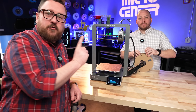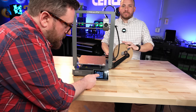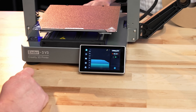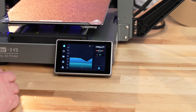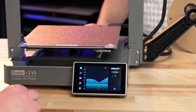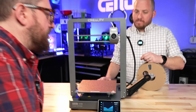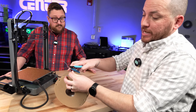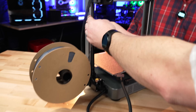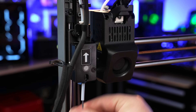We're going to go ahead and click OK, then figure out how to load the filament. I think we're going to select the hot end, take it up to 212 degrees Celsius and hit OK. We'll watch the graph as the hot end warms up. It's already at 136 and soaring upwards to 212 degrees Celsius where we will load our PLA Plus. Let's turn the printer around so you can see how we're going to load the filament. First we're going to take this and do a 45 degree angle on the snips.